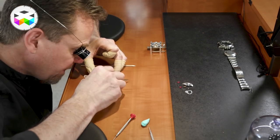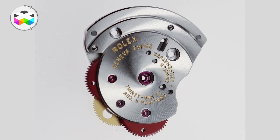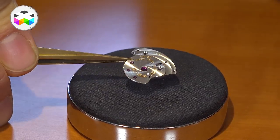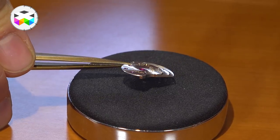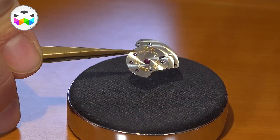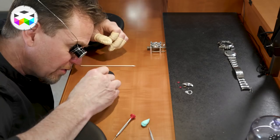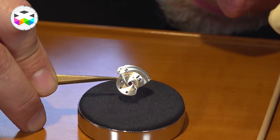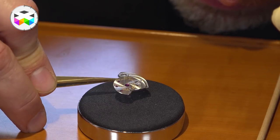On top of the bridge you have all of the Rolex engraving: Geneva, Swiss, Rolex, 31 jewels, adjusted to five positions. The bridges are decorated. All of the engraving with numbers is filled — or rather plated — with yellow gold, which is then protected. All the other surfaces are then rhodium plated. The protection for the engraving is removed, which reveals the yellow, giving a nice contrast between the yellow and the white chrome colour of the rhodium. Couple that with the synthetic red rubies and the diamond-cut angles, and you have a very nicely finished — industrially finished, mass-produced — but really quite beautiful component.